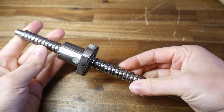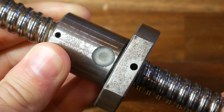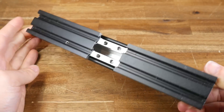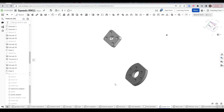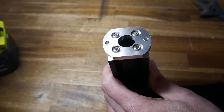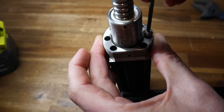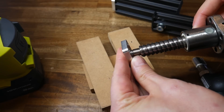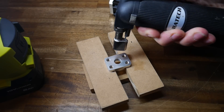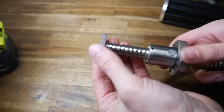So I checked my spare parts and found a ball screw. Implementing this would allow me to twist it in and out to extend or shorten the length as required. Ball screws have no backlash, and as you can see, there are ball bearings circulating inside, so they're quite strong when it comes to axial load. The short part of the leg would need to be converted to 40-40 extrusion, and to use it I would need to machine two more adapters for either end. The first has four holes to match the 40-40 extrusion and two holes to match the ball screw mount — it's bolted on to the 40-40 and then the ball screw slides down the hole in the middle before the final two bolts go into the threaded section of the adapter. The second adapter has a 10mm bore matching the 10mm shaft at the center of the ball screw. This is meant to be an interference fit — a really tight one — and the only way to get the two parts together is to heat up the adapter to make it expand, then use a hammer to bash the ball screw into position. This is totally not coming off without further bashing, but that's okay — I don't want any wobble or play.